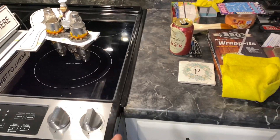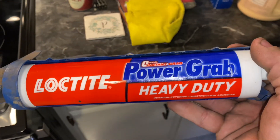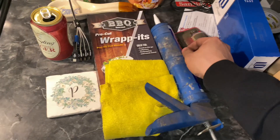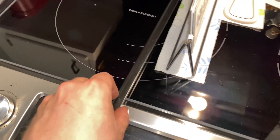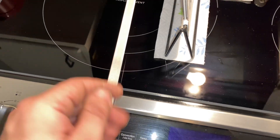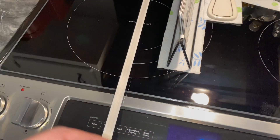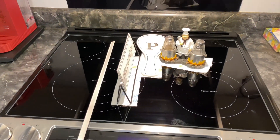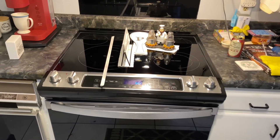As far as how I mount it, I didn't want to staple it or nail it or nothing, so I just got some of this — it's a Loctite power grab heavy duty interior and exterior glue, just goes into a caulk gun. Put a nice small thin bead right down the center — about a sixteenth to an eighth inch wide bead, nothing crazy — right down the middle, then just stick it down to the countertop. Make sure the 45s are tight, it's all about test fitting, and yeah I'm gonna get this put in and it'll be a done deal.